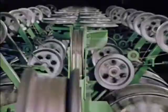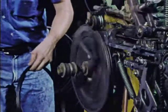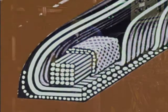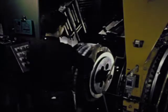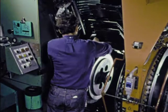Other wire, a different type, is processed into beads. In tire building, beads are pretty important — they keep the tire on the wheel. Bead failure is tire failure. In place, a bead looks like this: a set number of wires, high tensile stuff, in an even pattern, with the strength of a cable. Now, here, all of them — treads, plies, cushions, and beads — begin to come together.